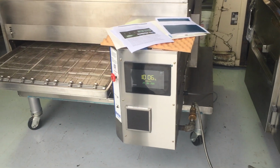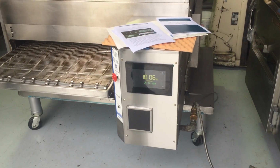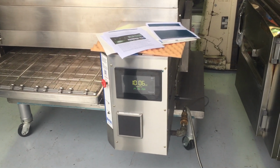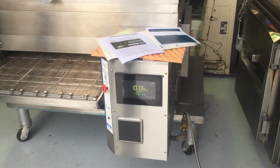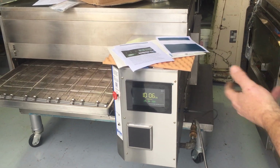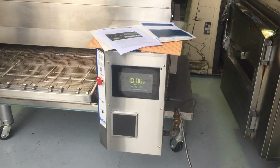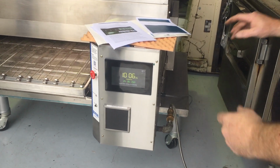It usually freezes up because it's evaporating quicker than it can produce the gas. So once it gets, as per the regulator with what I was telling you before. Once they start freezing up in there, they stop evaporating gas, and it struggles to get to temperature because it can't produce enough gas to sustain it.